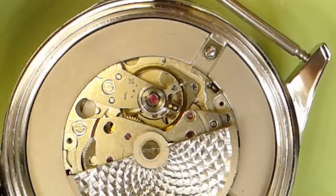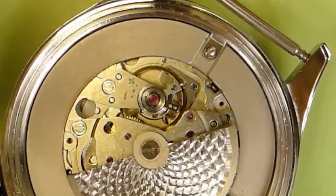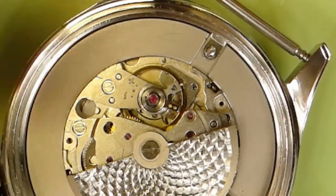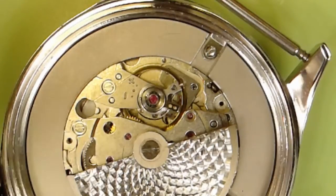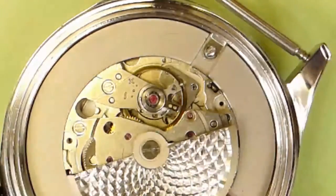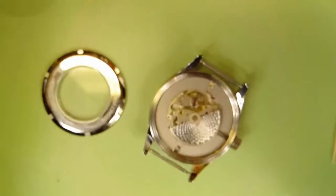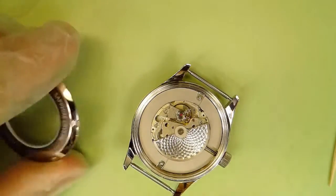After you've moved it, case the watch and test it. Go back to ToolWatch.io and test it — see where you're at. If you're minus 10 and that's acceptable, leave it there. If you're minus 20, obviously you want to speed it back up again. This could be a couple-day process to find the sweet spot, but if you put some time into it you can get these things to be fairly accurate — under plus or minus 10 seconds easily, I think. That could change over time, so you might have to adjust it again in the future.